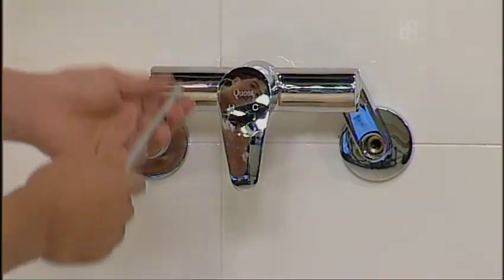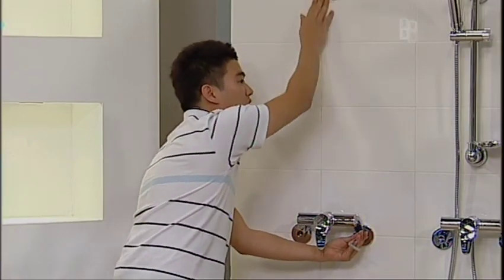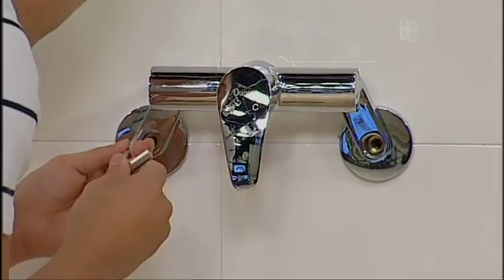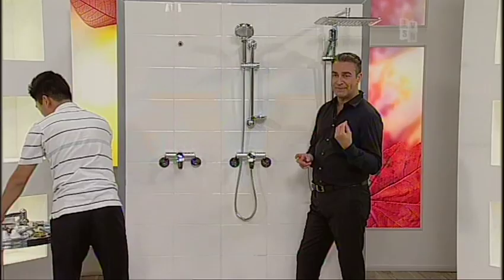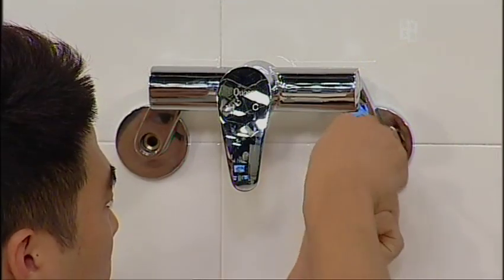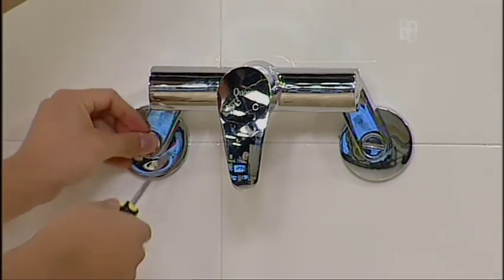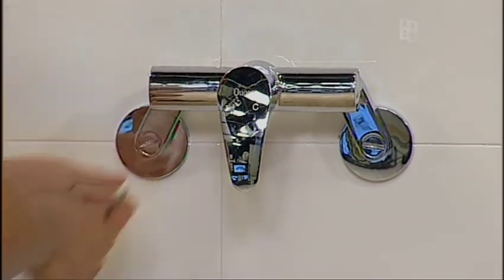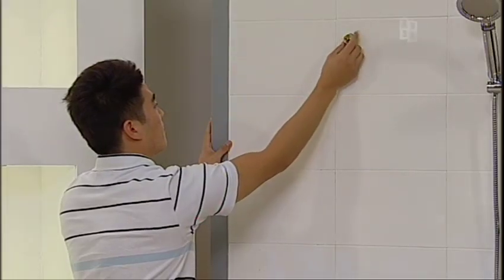The very important bit is you've got to tighten in the deeper cylinder because this is the most important bit that diverts the water — it cuts the water point here so it comes straight out from here. That tool is supplied — you'll be getting a smaller version of this key, but it's supplied with it. And one of the things I'd like to point out: you've now removed yourself from the hassle and waste of a two-tap system — the two-tap system that annoys you, that frustrates you, where you're standing there trying to get the right temperature. You're also wasting all those first litres of water because you haven't got the right temperature. Also, with this system you are now washer-free — it's got a ceramic cartridge that replaces the old washer system. That means no maintenance for approximately 10 to 15 years as opposed to 7 to 9 months.